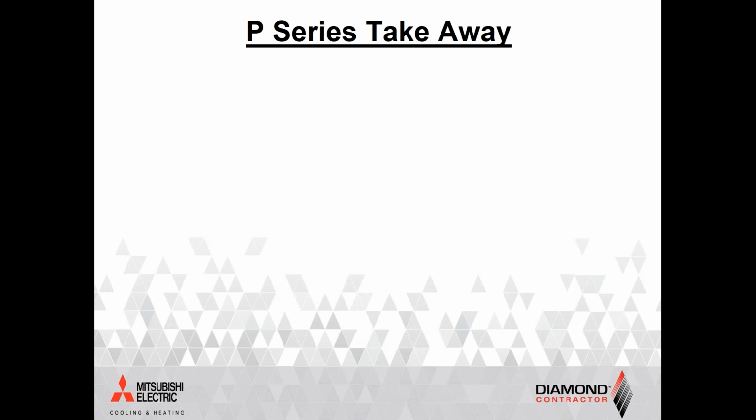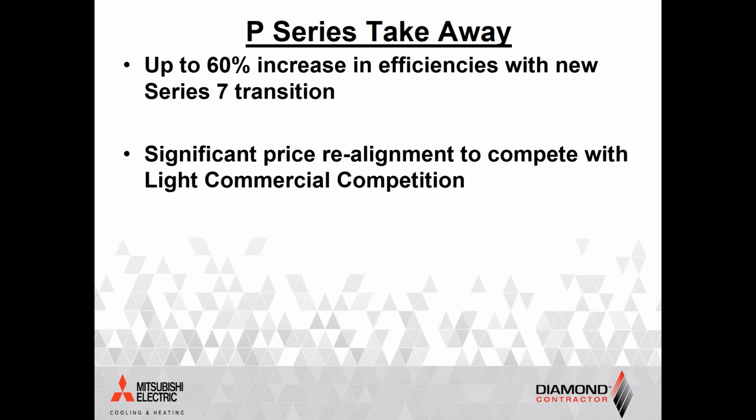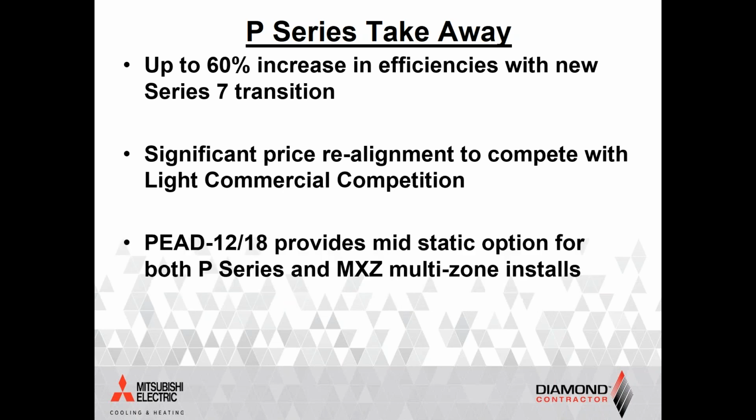So, some P series takeaways from what we went over so far. You can see that with the increases of our Series 7, we've been able to go up to a 60% increase in the efficiencies with that new transition. We've had a significant price realignment to compete with the light commercial competition that's been out there on the market. With the addition of the PEAD 12 and 18, I think this is a great fit for either a single zone P series application or to be tied into an M series MXZ multi-zone install when you don't have the room for the conventional multi-position air handler, but you need a little more airflow and higher static than you would normally have with the SEZ. Here's where the PEAD, especially with this 12 and 18, is a home run.